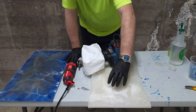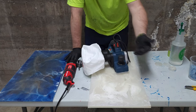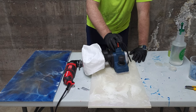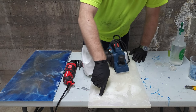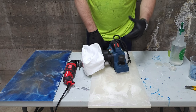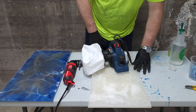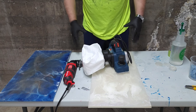Interesting development: I got this out of the mold and I got a little bit of alcohol that got underneath, which caused a very soft cure on the back from the new resin that came in with the alcohol. It's kind of a rubbery texture. So what I'm going to do is take my planer and run it through, taking out a little bit of the bow at the same time. You can see on camera there are ridges where the other resin came in and hardened weirdly. Even though it's on the back I don't like to leave it — especially because I have those soft rubbery spots where it was soaking in alcohol. I'm going to take that off. I won't bore you with the planing process — I'll be right back.